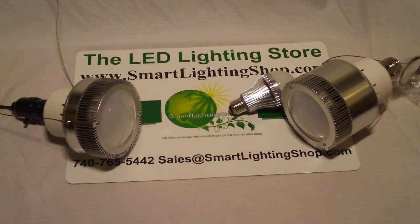They give you a pretty good coverage. They're IP65 rated with an aluminum housing. I put a small bulb, which is a regular e26 five watt, to show you the size difference. The 45 watt is an e40 base — Edison base, which is the mogul base. The 33 watt currently can come in e40 or it can come in the e27/e26 base, which is the standard base.